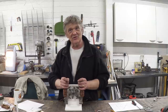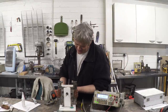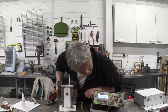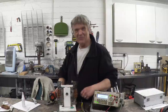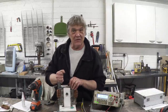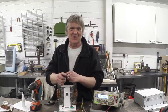Let's find some magnets and give this a test. There it is finished. I've got one coil connected and I'm going to put a drill on it — we've got the meter here to see if we get anything out of it. There you go: 0.4 of a volt. That's amazing actually when you think about it. There we go — a flux switching alternator built entirely out of an old microwave oven transformer. I hope you enjoyed the video, thank you very much for watching.